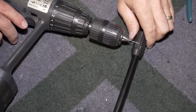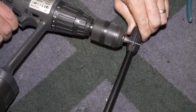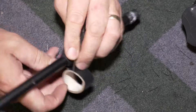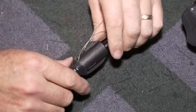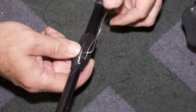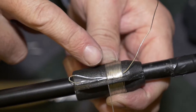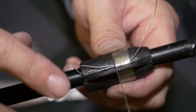Once you've cut it out with a Stanley knife, put your drill right on the edge and just go back and forth - not too much pressure or you'll just break the drill. Now that you've got the slot, it's time to bind it. Put a little bit of tape to keep the end in place. Now just go round and round. When you finish winding, the loop should be covered with wire - it should be flat, like a spring that just goes around.